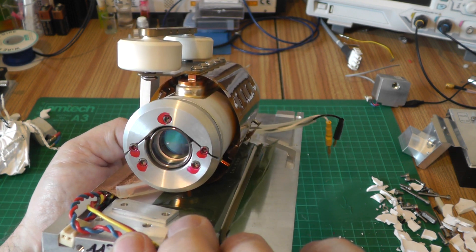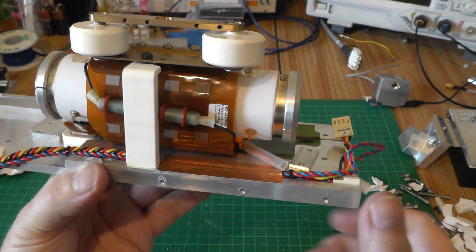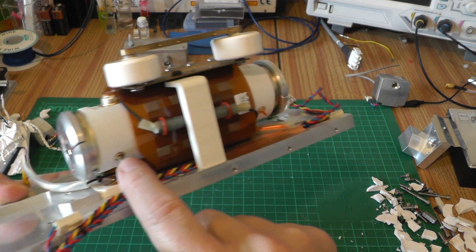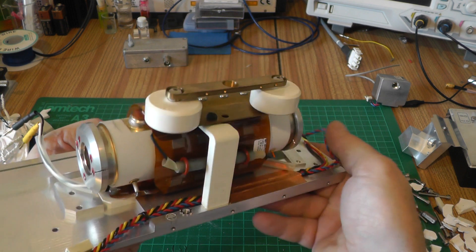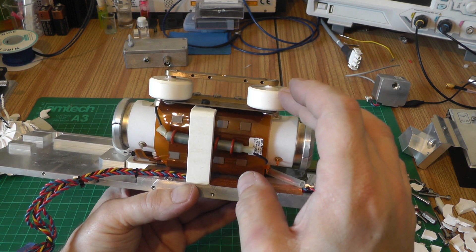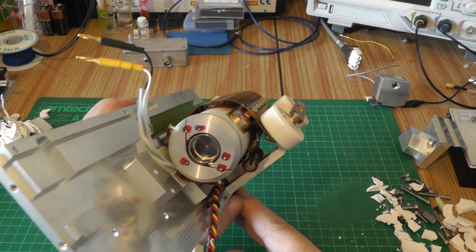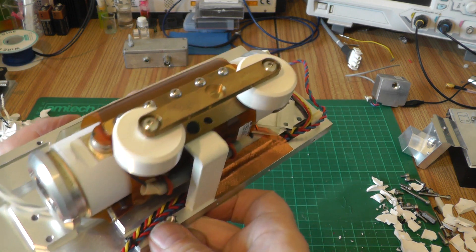We've obviously got a mirror mount on the end — better not touch that. There's a gas fill port tucked away inside a bit of silicone tubing at the bottom. The connection down here is coming from the two prongs we pulled out of the pre-ionizer, feeding into a flex PCB and up to the pre-ionizer electrode — one runs the length of the tube on each side. We've got dumper capacitors at the top. The peaking capacitor is actually mounted on flex PCB with an inductor that shorts the peaking capacitor to ground when it's not doing its peaking job. If we look very closely down the edge of the flex we can see they've actually got surface mount capacitors on there.